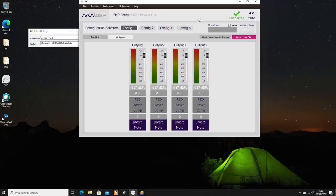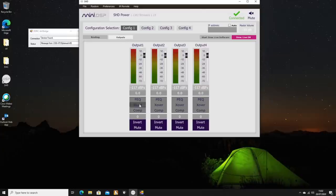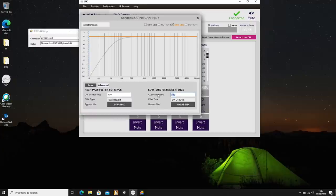More interesting for those with active subwoofers is the crossover function. To use this you have to link the two channels to output 3, or if you use two subwoofers to outputs 3 and 4. First set the crossover for the left and right channels — I use an example setting at 60 Hz with a Bessel curve, rolling off from 60 Hz. Then set output 3 as a low-pass filter at 60 Hz with 24 dB per octave roll-off. These are example settings only. You can make four different groups of settings, and for the adventurous the crossover can also be used to actively cross over a two-way loudspeaker system, though you need an extra power amp.